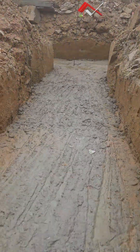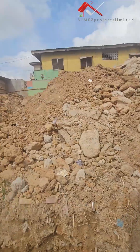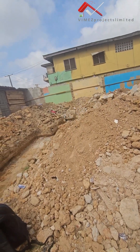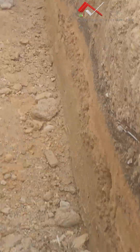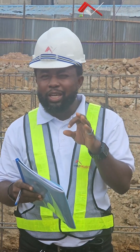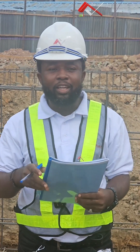On the surface we have this dark brownish sand on the layer, which is not too good for settlement. So when you get to 0.75 — that is 750mm — you should be able to get the reddish brown soil. With that, we are able to know your settlement can really get to the level that it should.